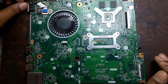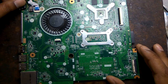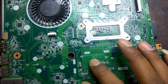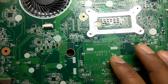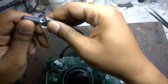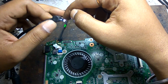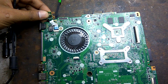Hello, welcome to Aadith11TTT YouTube channel. This is an HP 15 motherboard, part number DA0U83MB630. The problem is: when we connect the adapter, the DC jack light glows, but when we try to switch on, it's not getting on.